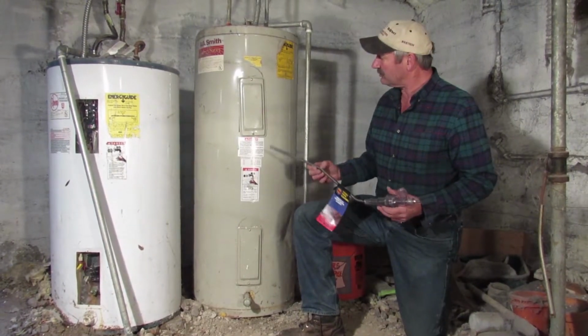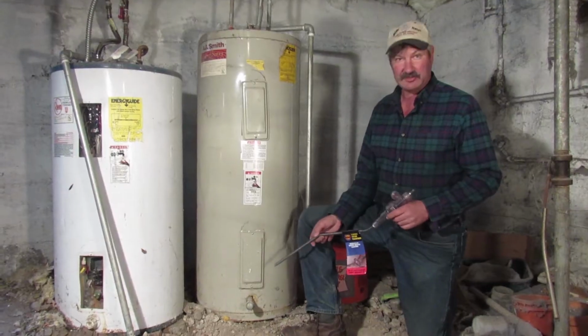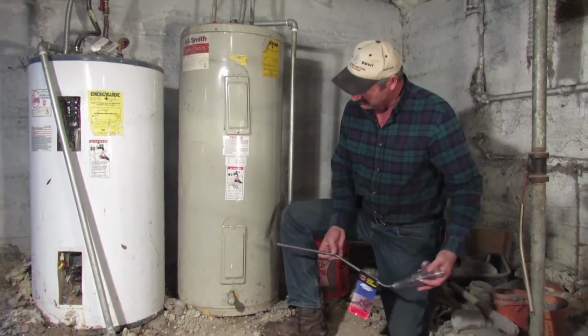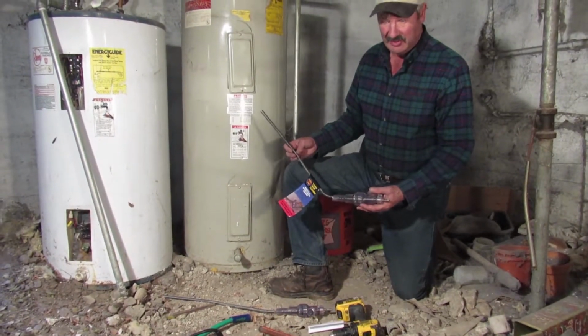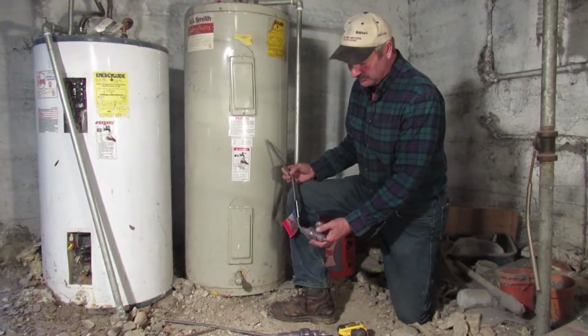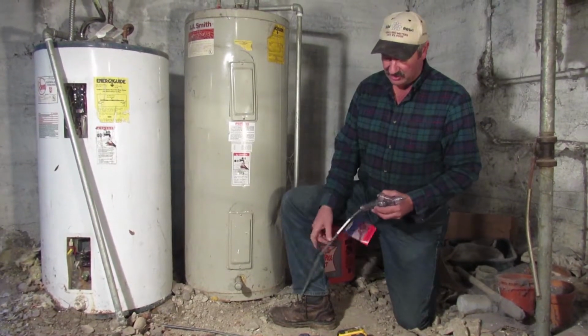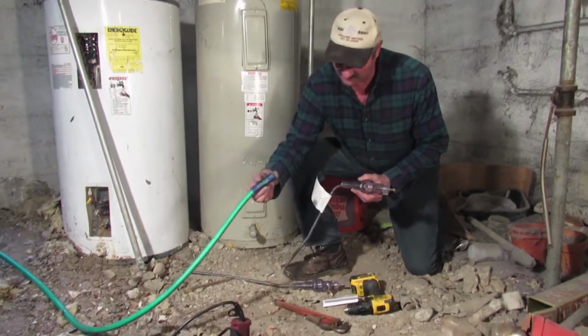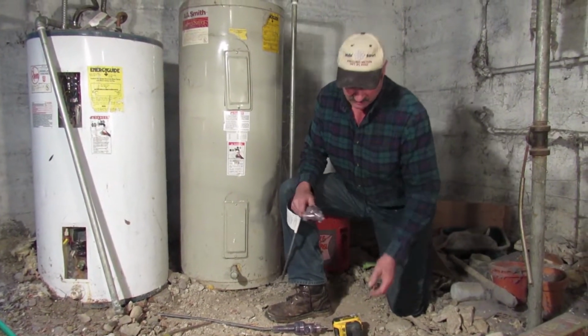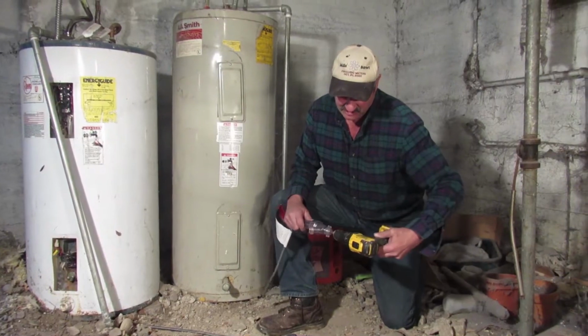The first thing you need to do is drain your tank and replace your tank's drain valve with the Turbo Tank Cleaner. This long kinked agitator is going to get shoved right up through all the sediment at the bottom of your tank, and then the tool is going to get screwed into place. Next, you'll attach a common garden hose like this right to the discharge end of the tool, and then you'll put a drill like this right on the shaft of the tool.